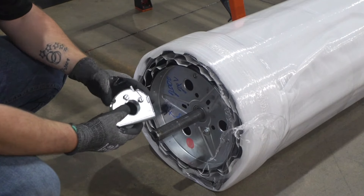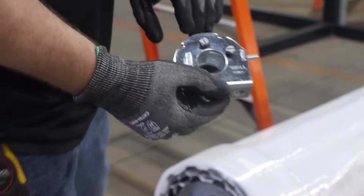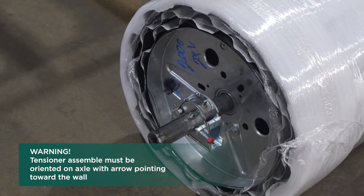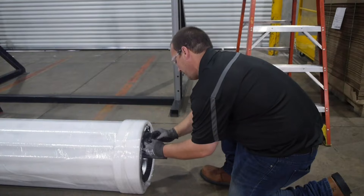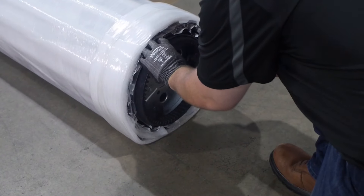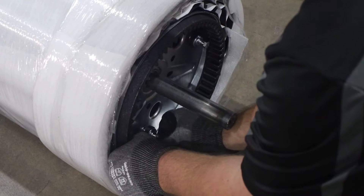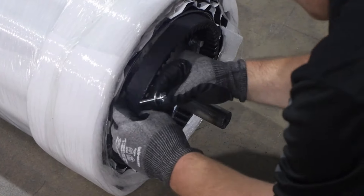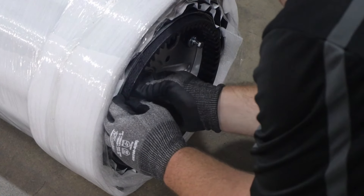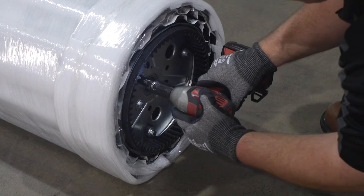Using the tensioner assembly spring roll pin located in the knurled wheel, rotate upward in the direction that clears the axle. Slide the tensioner assembly over the axle with the arrow pointing toward the wall. Release the pin. For the reduced chain drive end, fasten the 63-tooth cast ring gear to the drum using 3 each 3/8-16 by 1.5-inch hex bolts and 3/8-inch lock washers. Next, install 2 each 3/8-16 by 1-inch screws in the threaded holes in the cast axle support bracket.